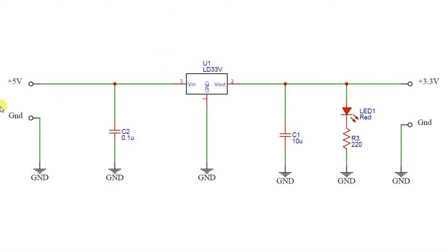Here's the circuit diagram. We have 5 volts coming in from our cell phone charger, a regulator which converts the 5 volts to 3.3 volts, a couple of filter capacitors, and an LED indicator with a series current limiting resistor. In reality you could probably build this with just the voltage regulator — you could get away without even having the capacitors — and the LED indicator is optional, so it's a very simple circuit.